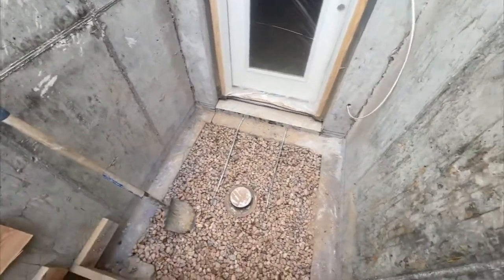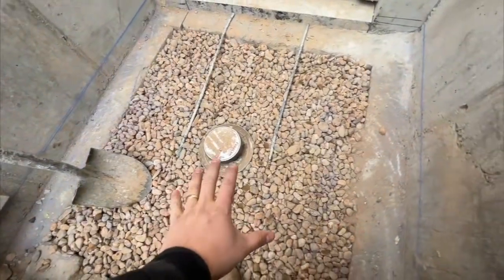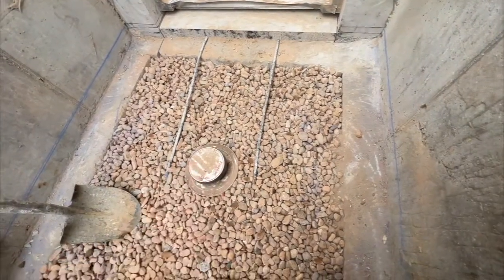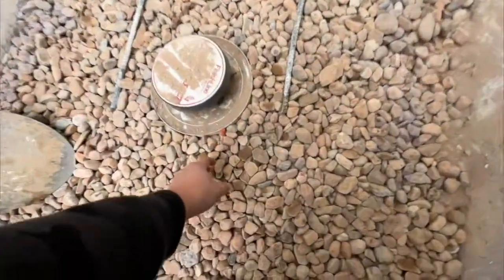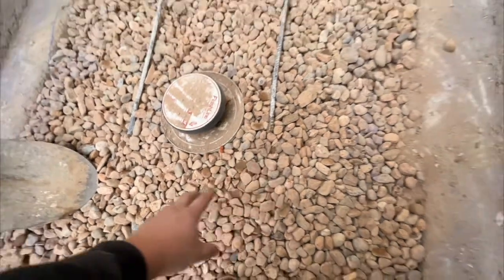This walkout is in Riverton, Utah. Down here at the bottom we dig down a couple of feet and fill this area up with gravel. It's important to have the right size gravel — this is one-inch gravel, and that gives us a lot of space around each of the rocks.